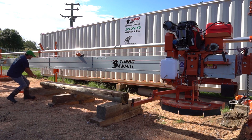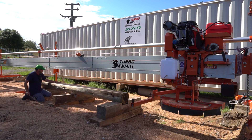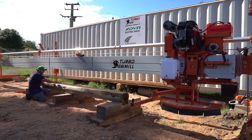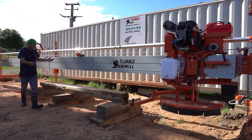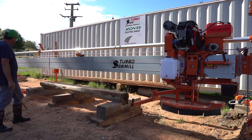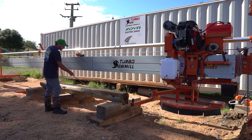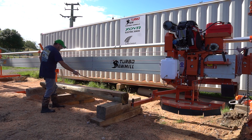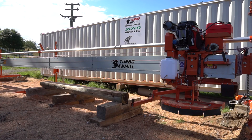When you do a return cut — reverse cutting back towards the operator edge — if you have a little bit of bark on the side and you overhang that blade too far, the blade will actually rise up on that bark. It's always better to chase the very outside of the log so it produces all the tension on the very outside rim of your blade and has less tendency to lift up. Swing blade operators quite often notice that at the very end of this last cut there's a little bit of a ridge, and that's purely because the bark is lifting the blade as it returns. Now it's just a case of dropping down six inches — I'll probably take a couple of boards on this side, maybe two or three, but I won't go too far or that log may tend to roll.